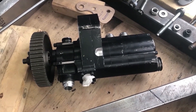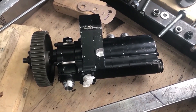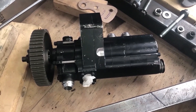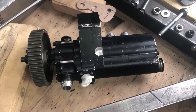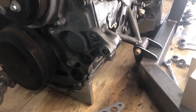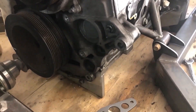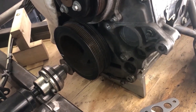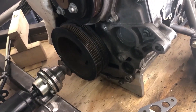This is a six-stage dry sump pump from NASCAR, made by a company called Auto Verdi in Europe — it's a good quality unit. I needed to mount it to the EcoBoost engine, and a good spot for mounting, I decided, was the alternator mount because it needs to go on that side of the engine.